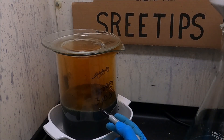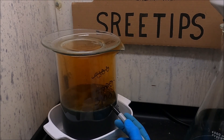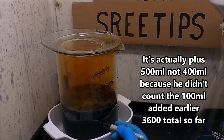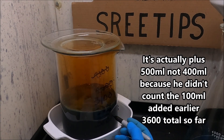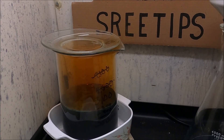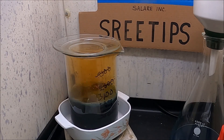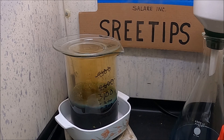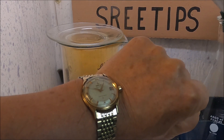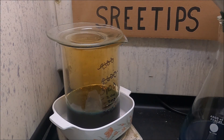All right, we got plus 200, and another plus 200. So I've got a total of 3,500 milliliters of concentrated nitric acid in there now — 3.5 liters — and it's still reacting. This is about an hour and a half of boiling condensed into a few seconds. Fume production is starting to lighten up here, so it's pretty safe to conclude that we've got everything dissolved. Time is 10 p.m. and I've been at this since about 6 a.m. this morning, and we've still got some fumes going on in there.